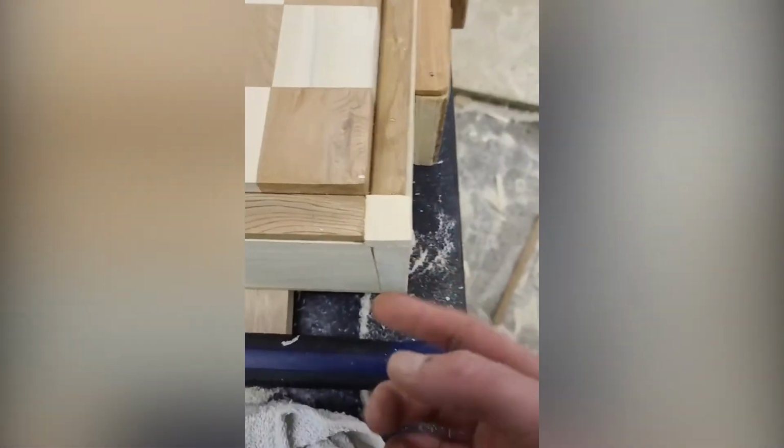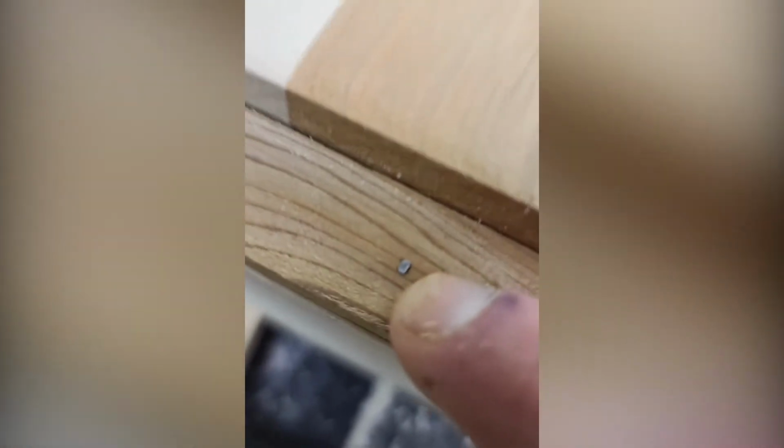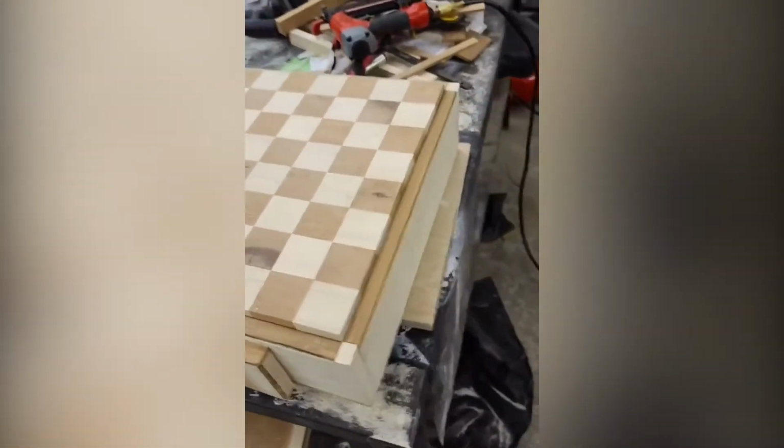I'm going to sand the parts where it's not great. On those corner pieces where they were hanging off, they were only held down with glue. So I just held them down with a finger and then used my palm sander to go across there and make it flat. So it ended up looking a lot better. Also, these little things I'm going to have to beat in and then putty, which will be easy. But yeah, dude, and then sand it and all that. And then we're good. So, very, very close, finally.